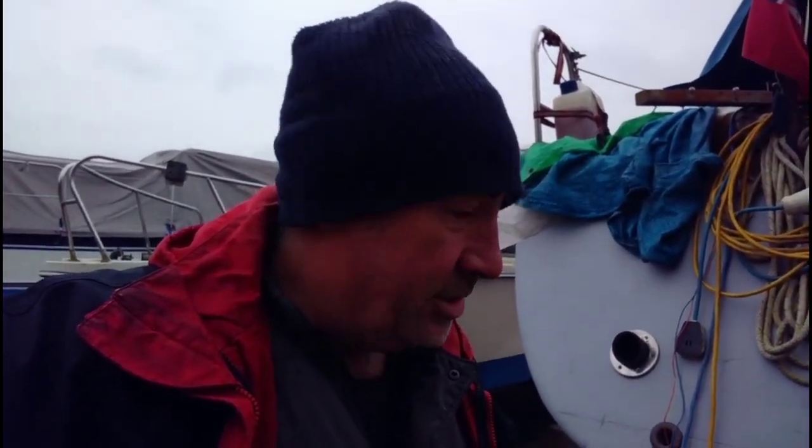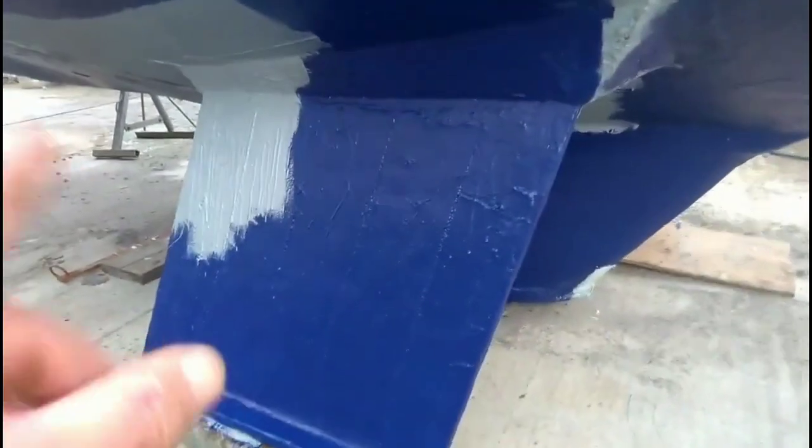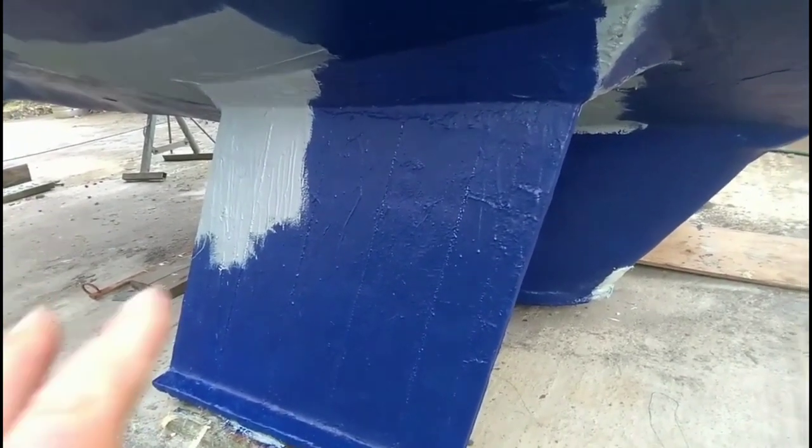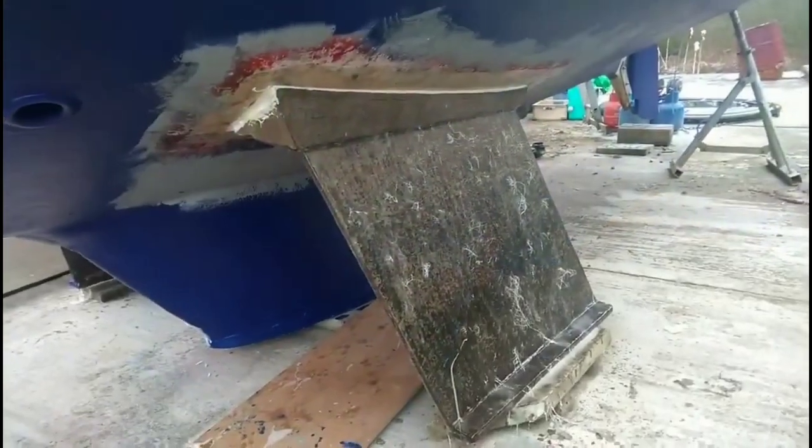The rubbish weather has come back unfortunately — it's pouring with rain and it's going to be here for a few days, so all the outside work has come to a standstill. I just wanted to show you one of the bilge keels because it's almost finished, to give you an idea of where we're heading with this project. This one is all sealed up with grey primer, blue anti-foul, plenty of epoxy, chopped strand mat — both powder and woven — so that should give us some good protection. This one over here has yet to be done. This has been a very expensive project — by the time I've finished with the keels I'll be looking at about £250 just to seal them with epoxy and fiberglass. But it's essential and it's worth doing. See you in the next video folks, all the best.